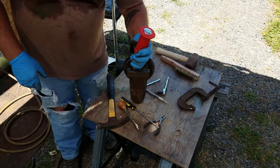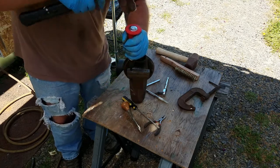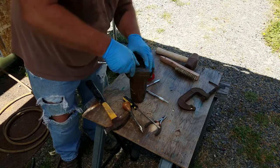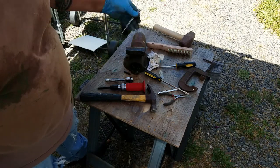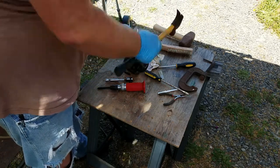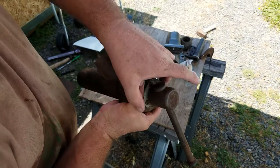With a fresh camera battery I got back outside and got back to work using my impact screwdriver. I went ahead and made short work of loosening the screws that hold the jaws in place — every time I whack that mechanism with my hammer, it turns the screw just slightly. With the screws out of the jaws, it's time to go ahead and take a drift and tap the jaw off of the vise. And there we go.